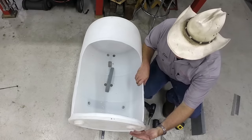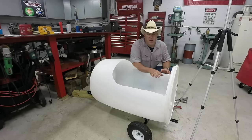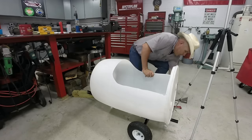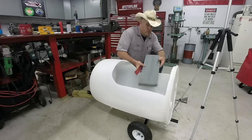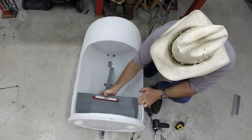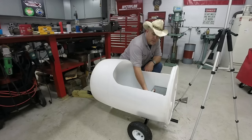Now, remember, we made sure that the back of this barrel was level. And this is where it starts to really pay off, because the next two steps for us, we're gonna draw on that measurement to make sure that everything else works level. We've got a small torpedo level. We're gonna rely on this for our measurement. Our seat in there and put our torpedo level in there. Now right there, that seat is level, meaning that seat is parallel or very close to parallel with the axle.